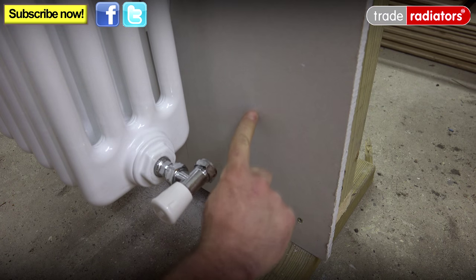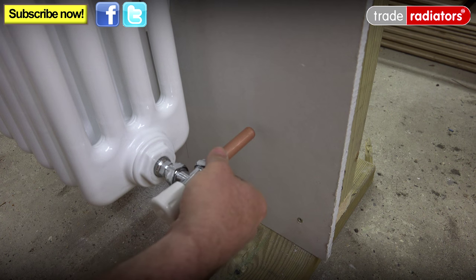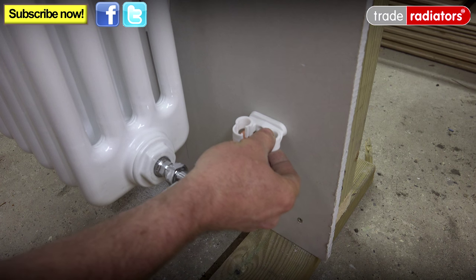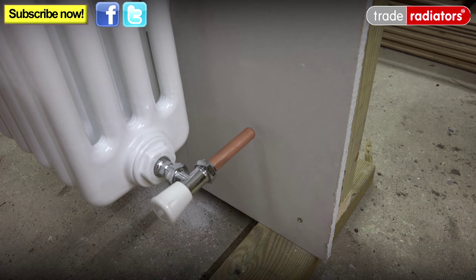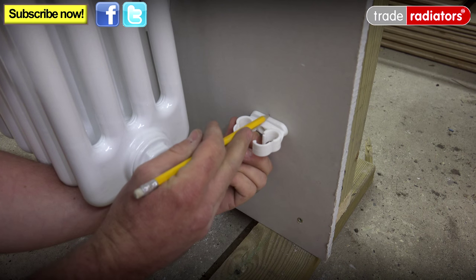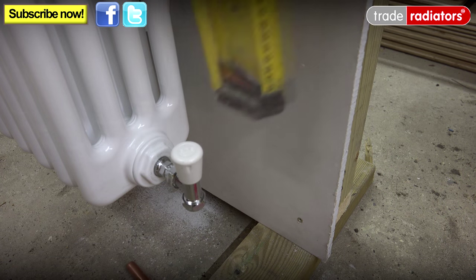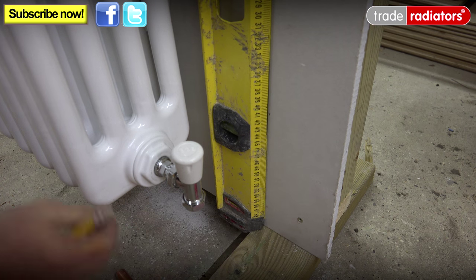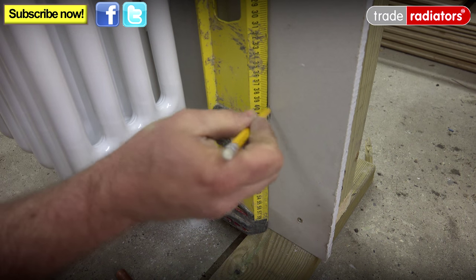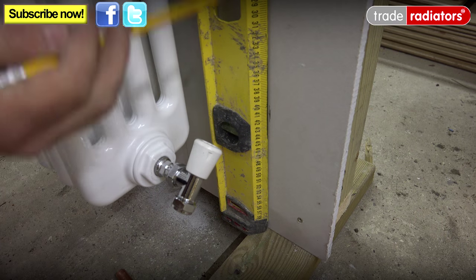Because I want to bring my first pipe down nearest to the left and then up into this first valve, I've cut a small piece of pipe so I can push this back to the wall and then I'll know exactly when I lay this on here where the centre of my double clip is going to be. So I can lay this on here just like that and then I can see that I've got one hole to drill about here. Then I get my spirit level on here, make sure that our bubble is in the middle as always, then I can make a small mark just about here, and then make a little mark further up where we want to put our other clip.